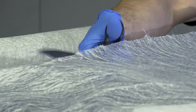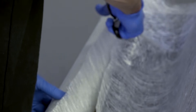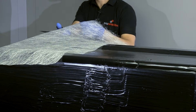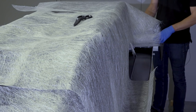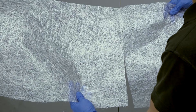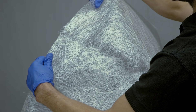The mat I'm cutting here is a very lightweight 100g mat, used only for the coupling coat where we will laminate two plies. The 100g mat is ideal for these very first layers as it follows the contours and details of the mould very easily. When cutting the reinforcement you'll find that cutting the kit of materials into panels that neatly fit the shapes and contours of the mould will make the layout much easier. The matting will cut easily with scissors or a knife. Where you have overlaps in the reinforcement it's generally best to tear the matting to get a feathered edge, which will make for a smoother and more level transition into the next piece.